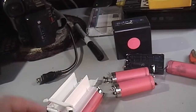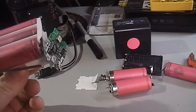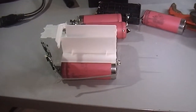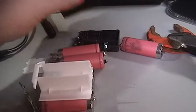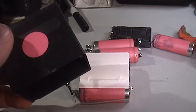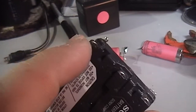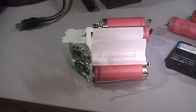I'm not sure what to do because this battery is nearly toast — there are three or four cells visibly leaking acid. I could try to rebuild it, but I could just buy aftermarket ones for very little online. It is kind of neat to see how these things are built. I could keep this shell, buy an aftermarket replacement that works, transfer its internals into this shell, re-solder the connections for the InfoLithium data system and the positive/negative leads back onto the board — though I don't know if I'd want to mess with a brand new battery.